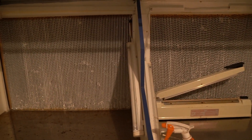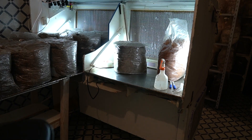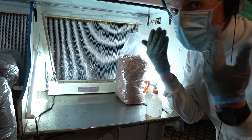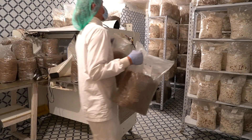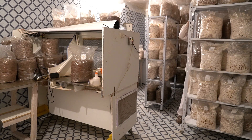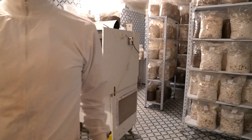Six-inch filters are fine for a laminar flow hood; I do 12-inch on my entry. Just size your blower right. If there are any questions, hopefully this video can spark a dialogue in the comments. It's easy, y'all — basically you just need to make a compartment, have a fan blow into that compartment, and the only way out is through a filter. Hope this helps, thanks for watching. We do have a fungus growing playlist you can check out. Thank you and signing off!